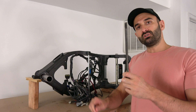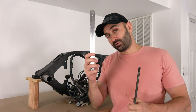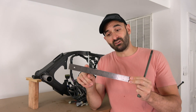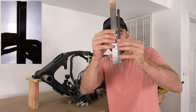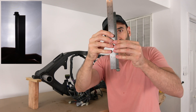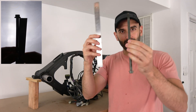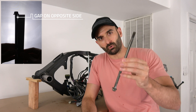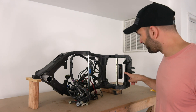I'm going to use engine bolts to make sure things are straight, and that's why we're using the ruler in this video. A ruler is usually pretty straight — the straightness is within 0.1 millimeter. When you run that bolt you spin it and make it walk on the ruler, then you check. I call that the light leak test: I put a light facing me, do that, and check if the gap is not uniform along the axle. That's what I checked for each of the bolts and axles I'm using.